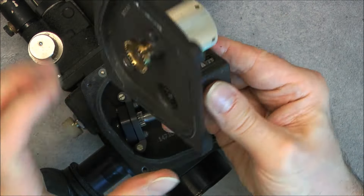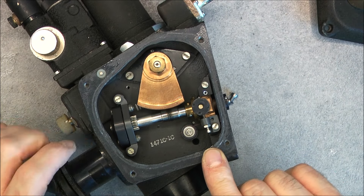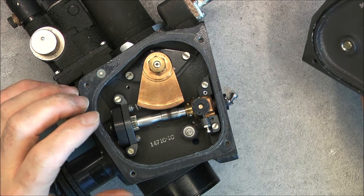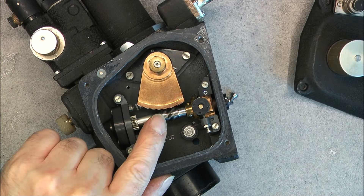Your control and mechanism here — a little counter. I will not take it apart any further because it must be super tedious. It is driving with this shaft here, which turns this one, and turning at the same time your counter and turning this part to drive your prism at the top. Nothing unexpected — just old school mechanism, very very well made.